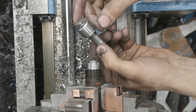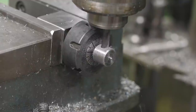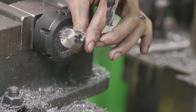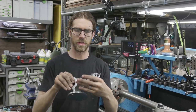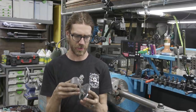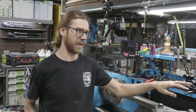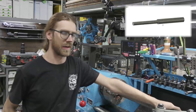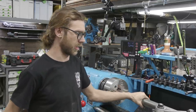This threaded handle turned out pretty nice — the surface finish wasn't bad at all. Over here in the mill I have this mounted in an ER40 collet block. We're going to be doing a cross hole for the sliding pin, that's what we're drilling now with a carbide end mill. This handle actually turned out quite a bit better than I thought it would — it looks really, really nice. We finished up this part. I went ahead and made a handle for this off camera — I just wasn't satisfied with factory made handles and tried to modify one but it just wasn't working out. What we're going to be doing next is machining the shaft. It's about 20 inches long and has a step in it. It also has a relief — kind of like a D profile in the step down — just so that it can be gripped and doesn't rotate.